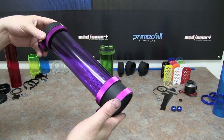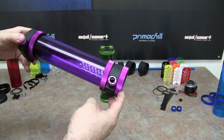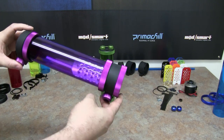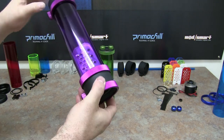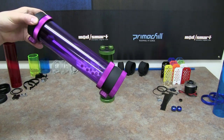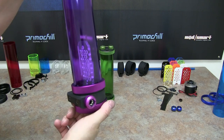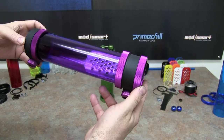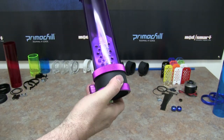There is a vortex killer, which basically — when we designed this pump head, we knew we would have a little bit of a vortex in there just because the pressure of that pump is pretty amazing. Being in a cylindrical tube, we needed something to block it up before it inlets into the pump. So we came up with this vortex killer to basically stop any vortex and have a nice fluid inlet to the pump.